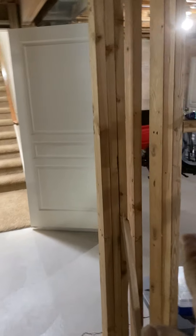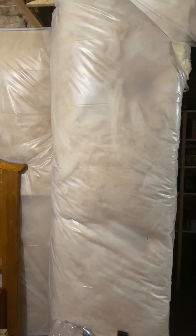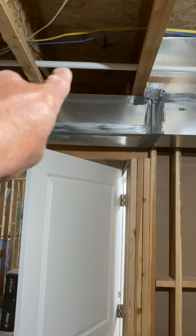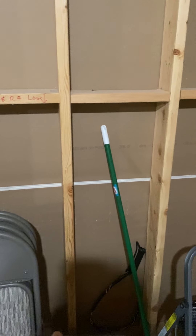This room back here on the right of the stairs — he changed it from the plan, so now we are going to add the 4x12x7 boot that was originally going to go on the other side — that's going to now go right here so you can get over the stairs. On this return air right here, we are going to add a 14 by 8 baseboard grill low. They're going to sheetrock the wall, but I made you a little two-and-a-half-inch fitting right here — you're going to cut out the back side of this duct and just tap into this wall.